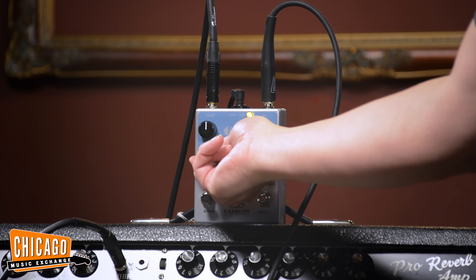Another thing that's really awesome about this pedal is that even if you have this cranked up and pulling the volume back a little bit, if you roll your volume back on your guitar, it still cleans up pretty nicely. That's a massive difference between full bore, so it's nice to have a pedal that's reacting to what you're putting into it. The work that John Snyder and I did was mainly focused on getting that clarity and responsiveness. By using op amps for the outer two stages, those volume control changes, picking dynamics, wider chord voicings — none of that gets lost. You can roll your volume back and play pretty cleanly, and then go full bore and it's just pouring molten gravy out of your amplifier.